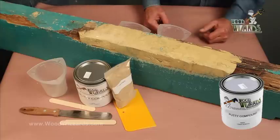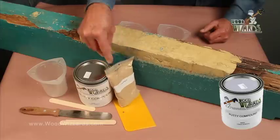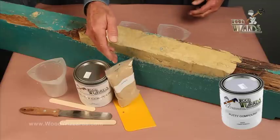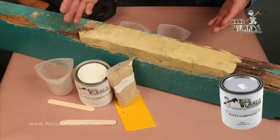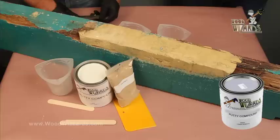The Wood Wizard is still curing — it's going to cure for a while — but we've got it really looking good and close to the shape. We're going to add some of our putty compound with some thickener to fill those voids, because the Wood Wizard dough doesn't go on less than a quarter of an inch. This ready-to-use product out of the can by Wood Wizards will fill those voids with no problem. To mix the putty compound, start with about three ounces of the ready-to-use compound and slowly add the dry thickening agent until we get it to a consistency that'll spread.